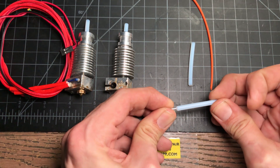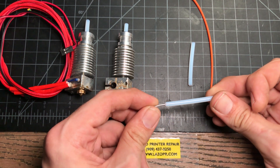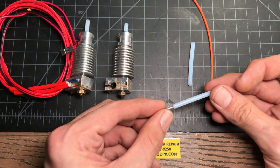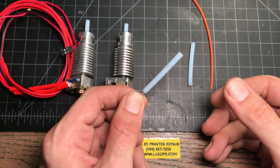You can see we've got some filament in there — it's not going anywhere. If this happens to you, I don't care how or why you switched your machine off hot, just know in the future you shouldn't do that. Basically the heat will creep into the PTFE liner and you won't be able to print.